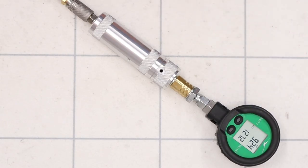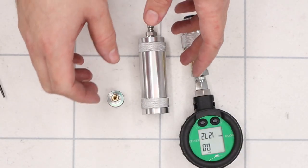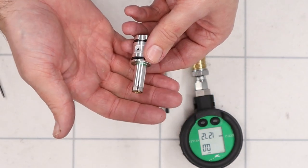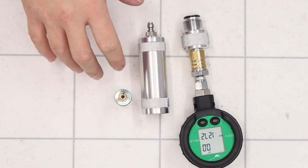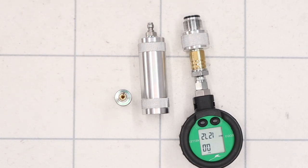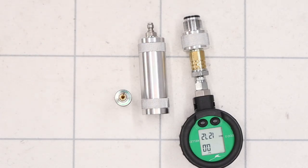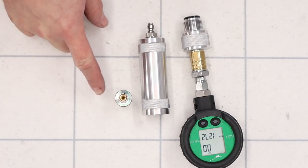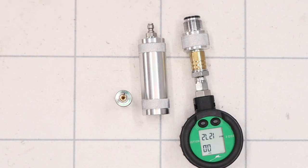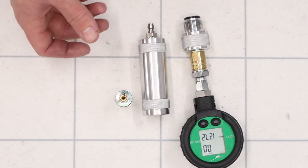By polishing up those two surfaces the creep normally gets a lot better — although one to two bar isn't that bad at all. Now that we know what our regulator is set to, I'll show you the adjustments. For every quarter turn of the adjuster screw, in my experiments a quarter turn equals roughly 33 bar of reg pressure change. So if you undid the adjuster screw a quarter turn you would raise the reg pressure by 33 bar, and if you did it in you would lower it by roughly 33 bar. Using the clock face analogy, one minute of adjustment equals around two bar. So doing the adjuster screw in 15 minutes (a quarter turn) would lower the reg pressure by around 30 to 33 bar. I say 33 rather than 30 because on average my adjustments were slightly over the two bar increment — however that may just be my regulator.